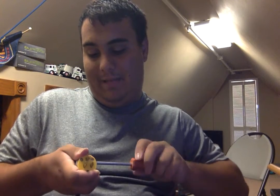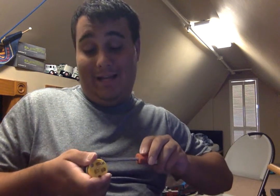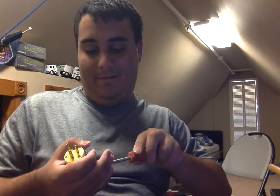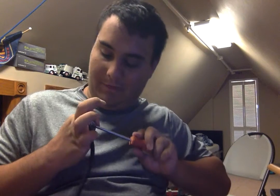But be careful — it could be heavier gauge wire, so make sure the plug you get matches your wire gauge. Otherwise you could have very, very serious electrical problems.